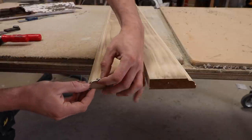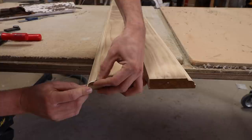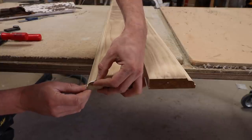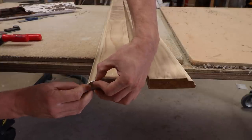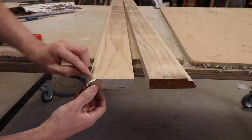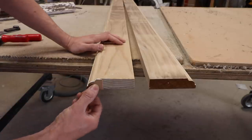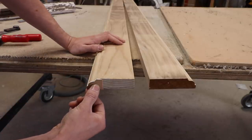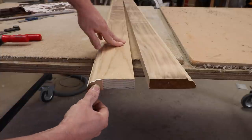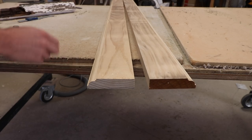That was fairly painless because that cutter was actually very close to what we wanted. So there we go, that's plenty good enough to replicate that moulding once it's been painted in along these edges and filled that round in like it's done on that piece. You could scribe that into an existing piece pretty much seamlessly there. So just to finish that bit off, we need to put the bevel on.